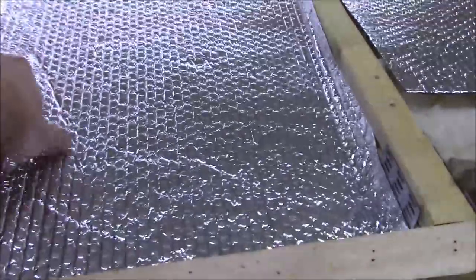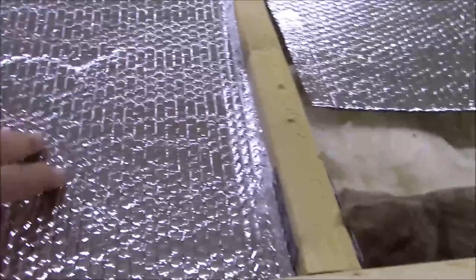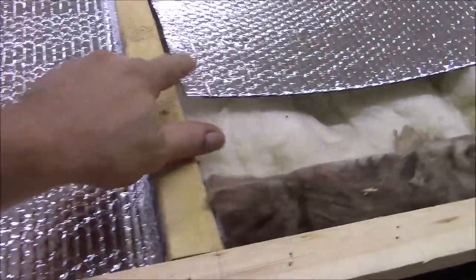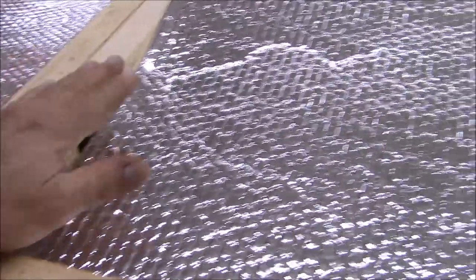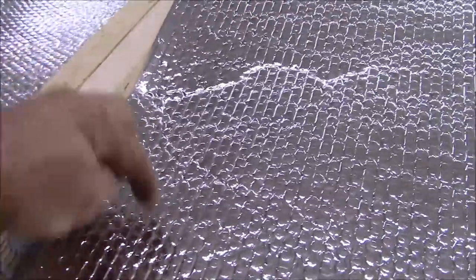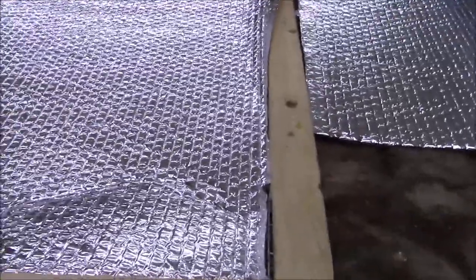However, if you look at LP Tech or Solar Board, those are sheathings that have the radiant barrier on the opposite side of it. And if you read the instructions on it, it'll tell you to have a cavity from the top, from the foil to whatever, about 3/4 inch. So you're supposed to have a drop down. That'll work more efficiently, so it says. So just laying this on top would not have as much effect as if you actually drop it inside, theoretically, according to what they're saying.